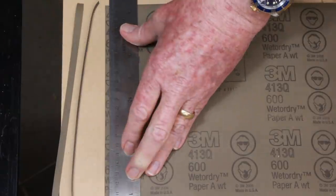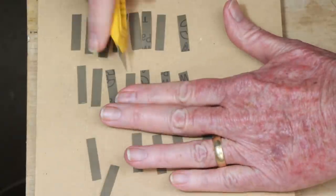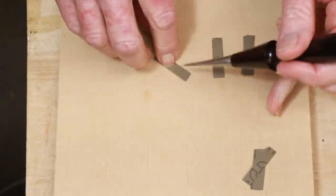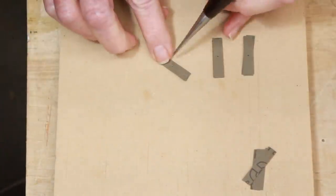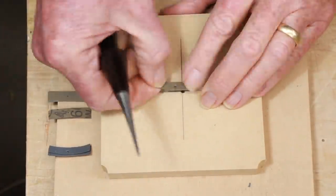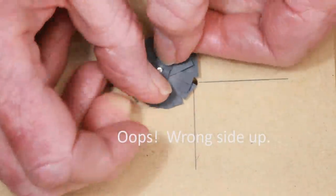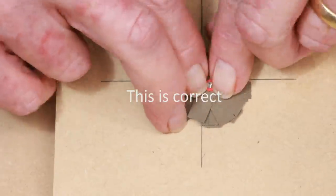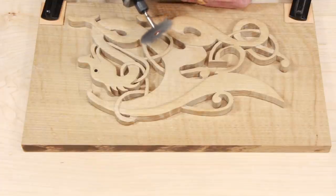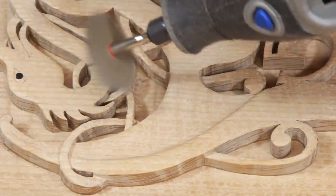You can run the drill both forward and backward, so the strips rotate into narrow angles. Although this flap sander looks blunt and clumsy, you can actually direct which areas get the bulk of the sanding surprisingly well. I also made two versions of this sander for use on my Dremel tool — one in 400-grit and one in 600-grit. They're only about 30 to 35 millimeters wide, or inch and a quarter to inch and a half, and allow much more precise positioning. I bought a package of these little mandrills online for a trivial amount of money, and they work okay. The little screw at the end, however, is shorter than I'd like, limiting the number of strips of sandpaper that you can employ. I think a small machine screw that will fit in a Dremel collet would actually result in a better sander.